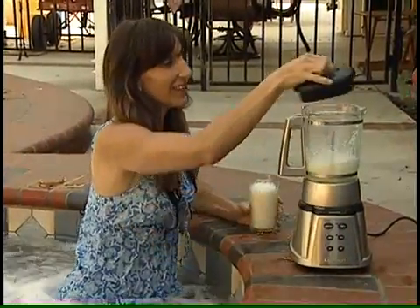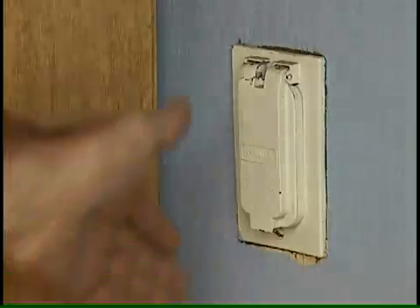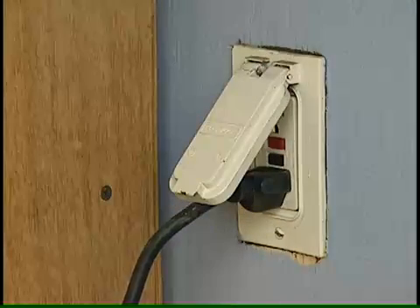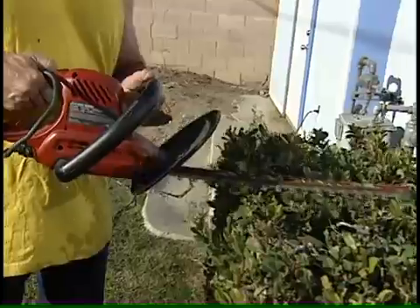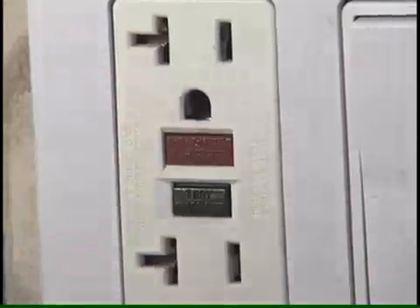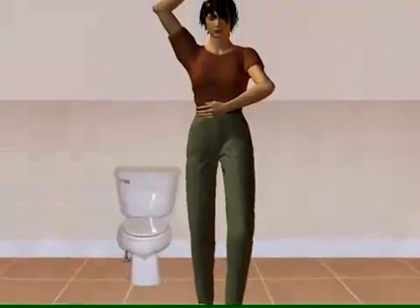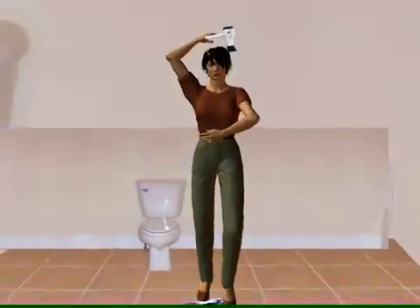The best protection is to make sure that all outdoor equipment is protected by ground fault circuit interrupters. A GFI is a smart circuit breaker that continually monitors all wires going to a circuit. If any current starts to float around, the breaker trips. It's specifically designed to prevent electricity from flowing through a person. If you used one with a faulty hair dryer, it would react so quickly that you wouldn't even singe a hair.